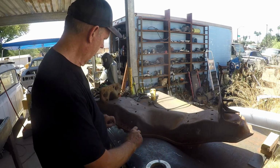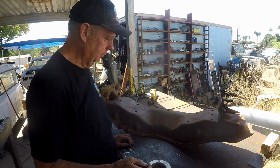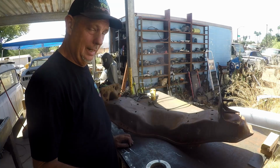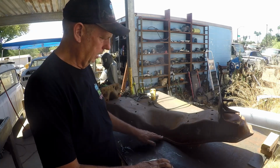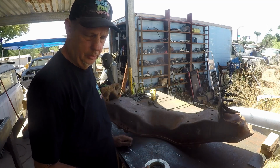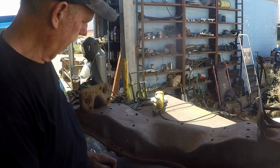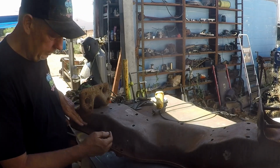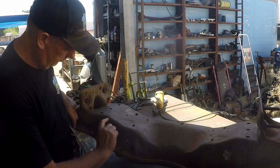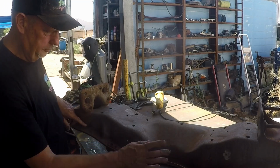One of the easy ways of doing this is you take a piece of 2-inch tape, and that is your mark, and you know exactly where you are. That being said, 1.88 is going to work. We'll just scribe a line, and we'll cut to the outside of the line, and we'll be close. It doesn't have to be exactly 2 inches. It has to be at least 1 3/4 inches. Otherwise, the bottom of the cross member will hit before the frame hits, and we're trying to lay frame. That's what he wants to do, is lay frame. So it needs to be at least 1 3/4 inches. What we do with this is we scribe a couple lines, find out exactly how far we're going to go. We put a piece of 2-inch tape, or 1.88, and that gives us our marks. We cut it real nice, and we'll be able to go through and do this.